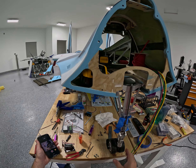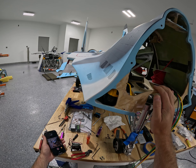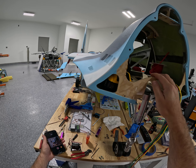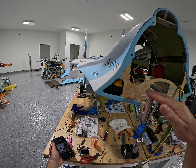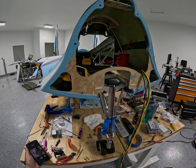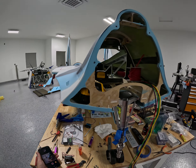Once it's all done and built, if I can adjust the pressure, you get about a half stroke on it — that's kind of what you want. That way you've got some down and some up. You don't want it fully stroked because that typically is too hard and doesn't really do much for you. A lot of people do that to help get the nose up, especially on the F-18s, so they cruise along like this — gives it a positive AoA to help it take off. The Tomcat does that just because the thing's so heavy and the mains squat so much with fuel on them.